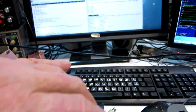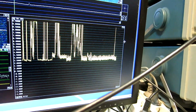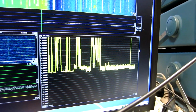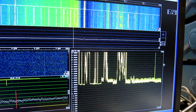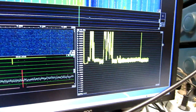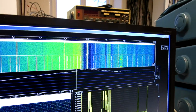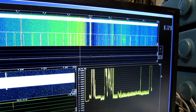I have to put the lid here to get a reasonably clear screen. Now you can see the noise floor, and I have some instruments running that create interference. But when I increase the signal level, I come to a point where there is suddenly a lot of noise. And half a dB down, and it disappears.